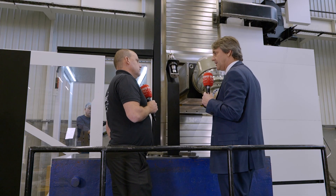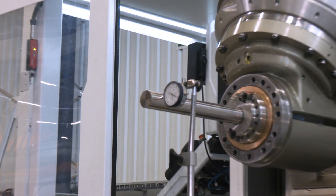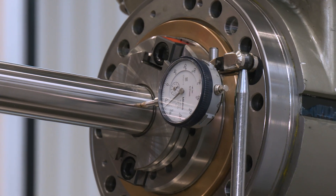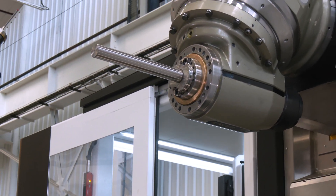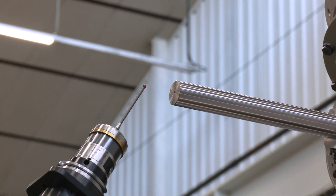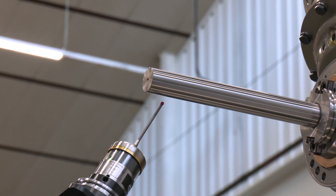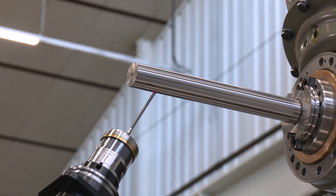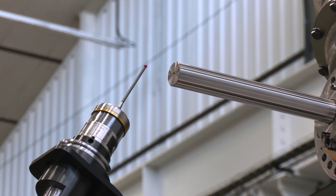The horizontal line is no longer in the correct position — it's in another place in the space. You will see how the indicator is showing us that the level is lost. After the minor incident, the probe cycle — the Eichel cycle — is automatically generated. The operator has nothing to do but wait until the probe is touching the cylinder in several points to know exactly which is the center line of this shaft in this position. It will detect that the horizontal line is lost, and thanks to the 360,000 positions in each joint of the head — a simultaneous five-axis head — we have the ability to self-calibrate the head to the proper position, coming back to the zero line.